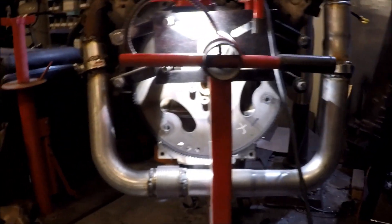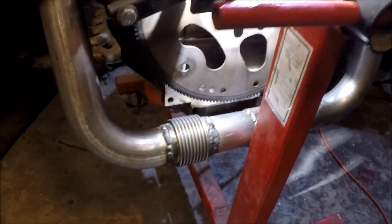It's about 80 percent welded and it's in there ready to go. I want to pull it out to finish weld it, but I want to let it cool first so it doesn't warp or anything like that.